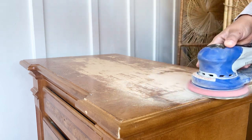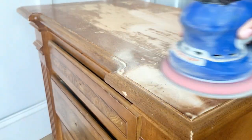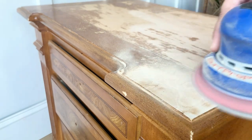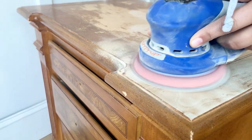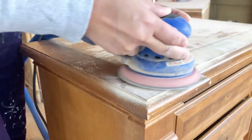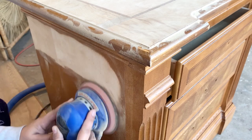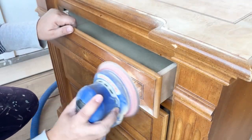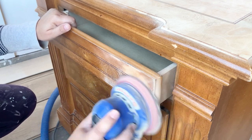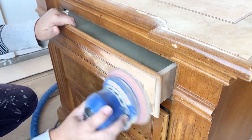Well, because today I'm breaking a rule when it comes to sanding. The veneer that's covering that top MDF is a really thin layer of wood that's really, really nice, and I want to preserve it as is, which means that I don't want to sand through it. To avoid that risk, I'm using a 220 grit sanding sheet. If for some reason the veneer doesn't take on the stain like it should, I can always apply another coat.